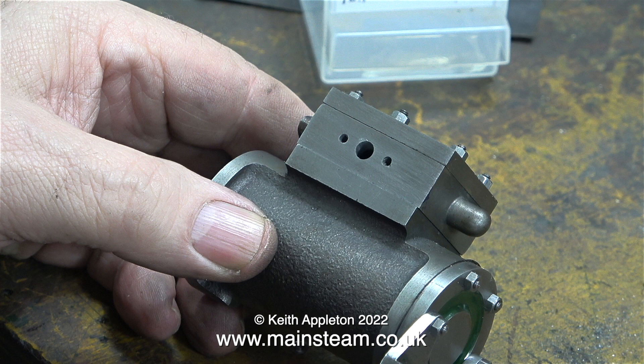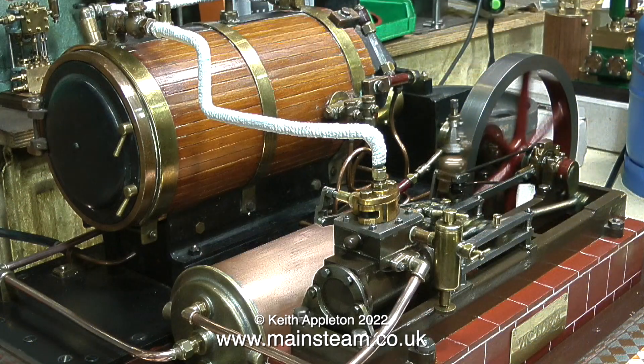The question is: was it worth making the modification? The steam inlet flange is still not perfectly in the middle of the steam chest, but at least it's going to look better. On this Stuart Victoria steam plant, I do not like the position of the steam pipe from the boiler to the engine for two reasons: it looks awful, and it's the hottest part of the steam plant right where you're likely to touch it with your hand — and even though it's clad in string, it still gets very hot. Stay healthy, thanks for watching, and I hope you found it useful.